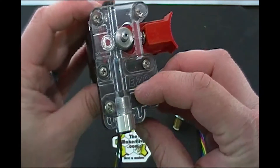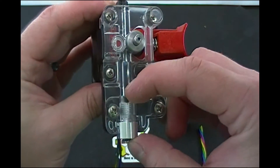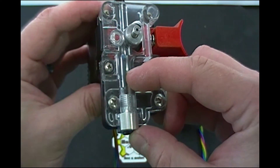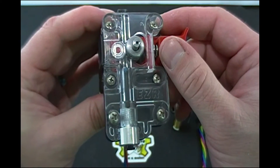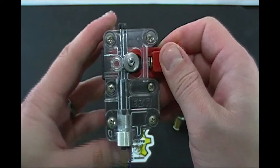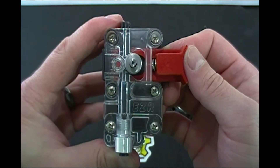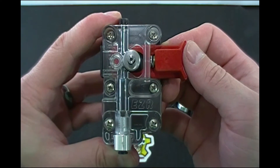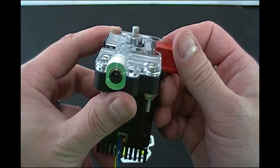This is a piece out of the brand new hotend. The hotend screws together around the circuit board that has the accelerometer in it, and that's why that piece is shaped that way. So not quite as universal as the previous versions, but definitely great for standard equipment on the machines and for anybody still using a Bowden tube. This is the fitting you want anyway, so who cares what the adapter is?